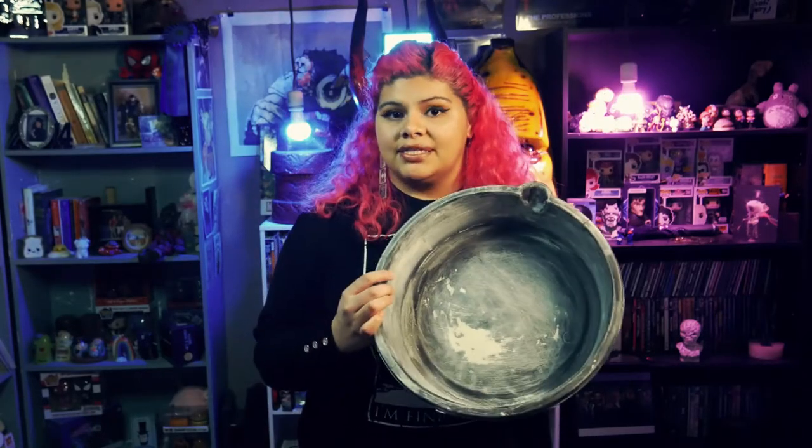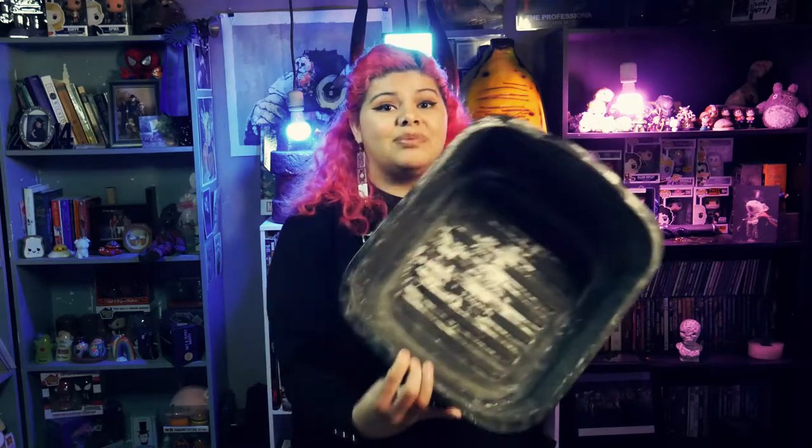To round everything out you'll need a mixing bowl or pan to mix the stone, some kind of container to pour water, a cup-like container, a whisk to mix with, a chip brush to apply, and some gloves to keep your hands clean — plus a cleaning bucket to wash your brushes and pans. Do not dump your stone or anything that touched stone down your household pipes. Don't do it, or your parents will hate you and disown you.